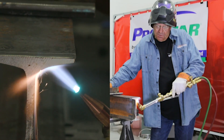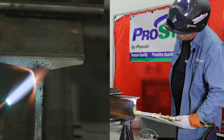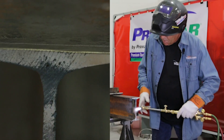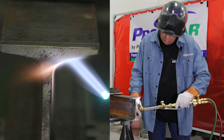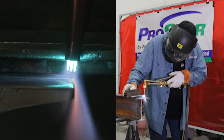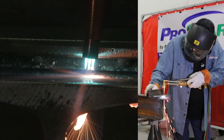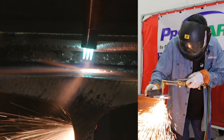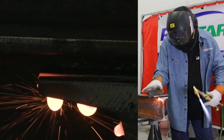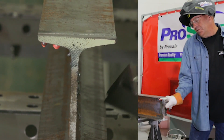I'm going to throw a little preheat right down here in the throat with this radius here. There are all different shapes of beams — S, I, W. This is more of an I shape. I'm going to bring this over on the edge of the flange and blow a little bit. I don't want to pierce the beam in the web going back into it that way.